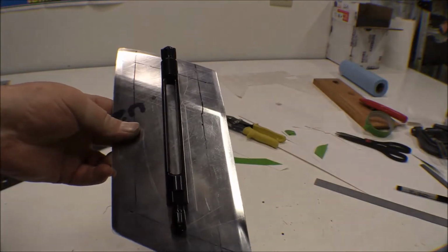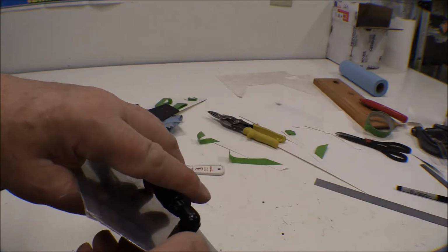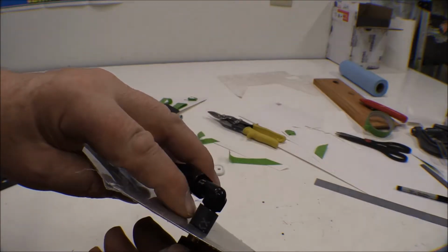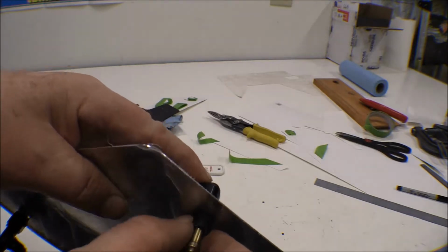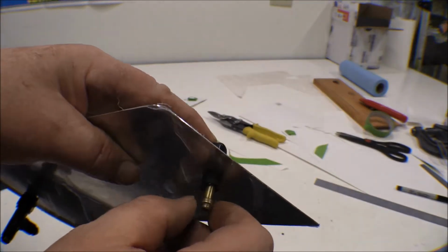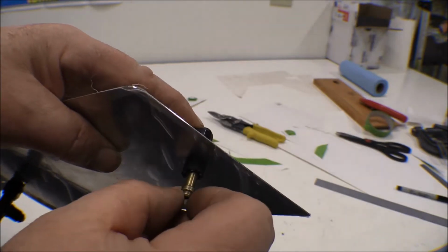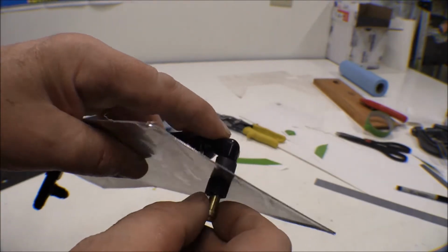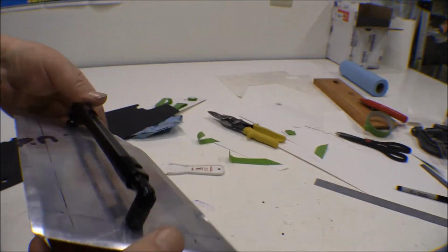And this is what the plate looks like now. You can see I've got a piece of 1/4 inch fuel line put on there for a spacer. Then I can put another piece of 1/4 inch fuel line on this side. I just got this one on there just to hold it temporarily, but when I put the regular 1/4 inch fuel line on there and a hose clamp, that'll hold that tight with a nice space across there.